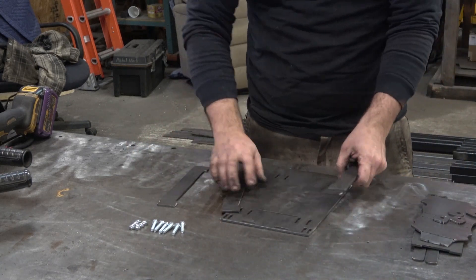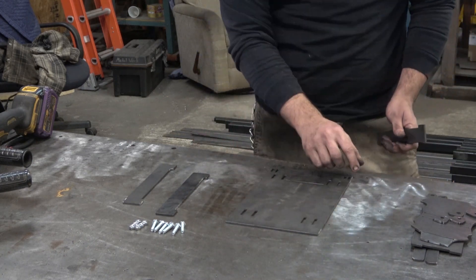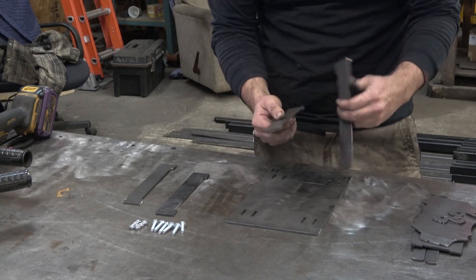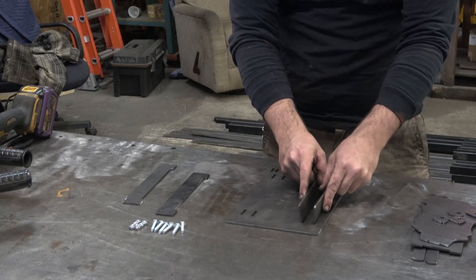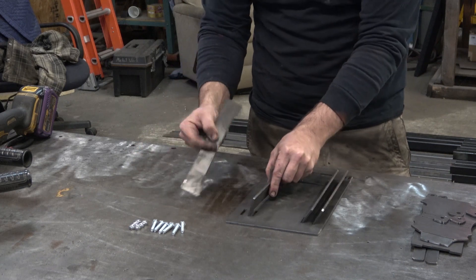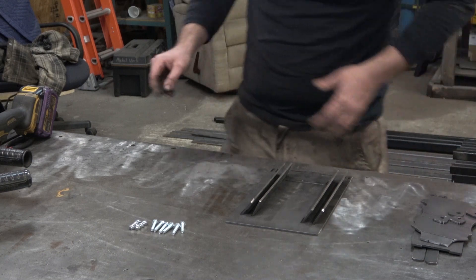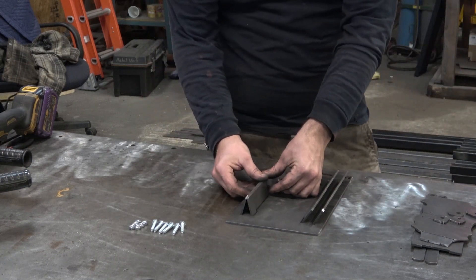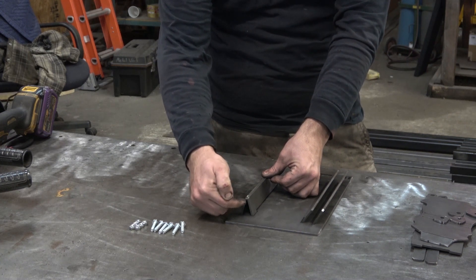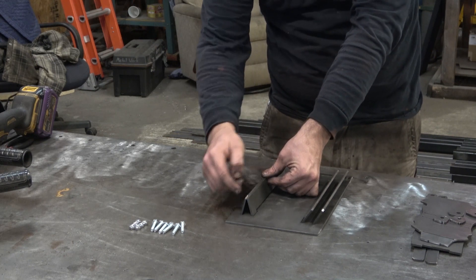What you're going to do with these is in pairs. Your back plate — the side with all the extra crap on it is the bottom. You're going to take your little eye bar things, set them in the slots here, and just lean them against each other. Don't worry about getting them perfect just yet. Now you're going to grab your welder. What we're going to do is get these to sit dead even, make a nice little triangle right here. Put a tack on the very ends — you can do it on the top face, but it's better on the ends.